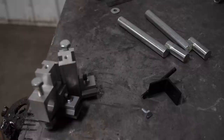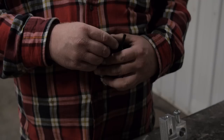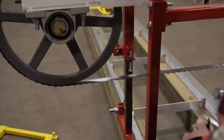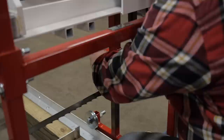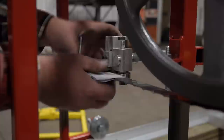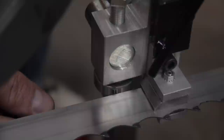Blade guide installation. Prep the guide by loosening the Allen bolt in the center of the guide. The black lube bracket gets mounted to the guide on the operator side A using a quarter-twenty bolt provided — this threads in from the top of the guide and will mount the bracket to the guide. Insert guide pin into the frame with offset facing toward the outside of the mill frame. Place guide over the blade, move the guide pin into position, and slide guide onto the pin. Repeat on the other side. Take a piece of paper and place it over and under the blade, then holding guide shoes to the paper, tighten the Allen bolt. The guide will now be adjusted and set. Make sure all bolts are tight. There will be an 1/8 inch space between the backstop bearing and the back of the blade.